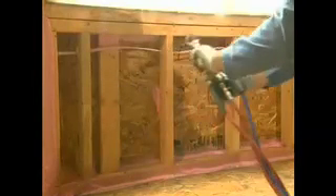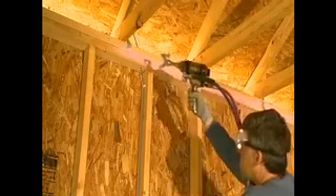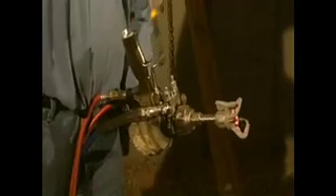Windows and doors are often sources of significant air leakage. Cavities above and below the windows are treated as standard cavities, and all multiple studs should be sprayed on the face. There are other unique applications included in the manual that accompanied the Energy Complete Sprayer — these include studs used as return ducts, garage bump-outs, walk-out basements, and more; refer to the manual for additional information. When you are finished with the installation, close the gun manifold valves and engage the safety. The same procedure should be followed if you won't be using the gun for five minutes or longer.